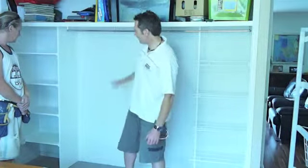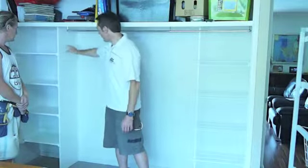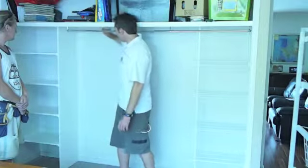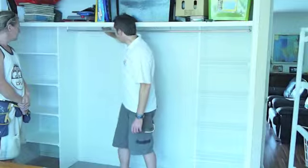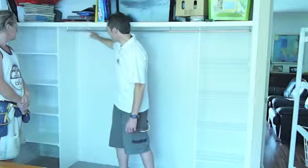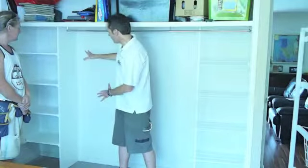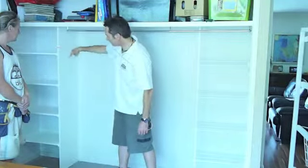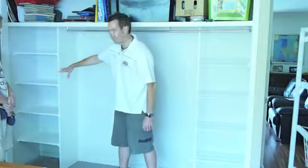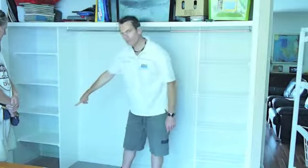It's a very versatile system and it's quick. We measured and cut the panel, put the channel on cut to size, and fitted it underneath these old wardrobes which have an existing cleat. Warren simply used a hacksaw to cut around that — going really fast. Then we fitted the brackets and channel on the back, slotted in the existing solid shelves, and screwed up underneath for the bottom shelf.